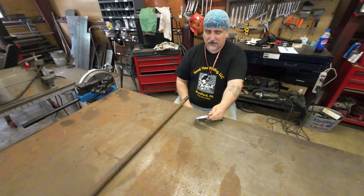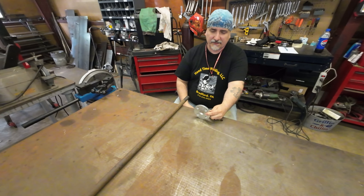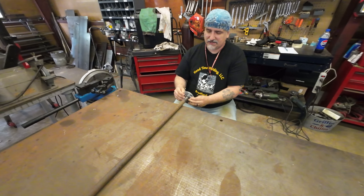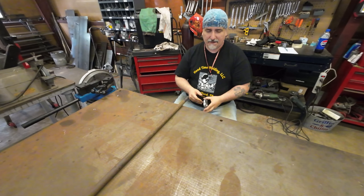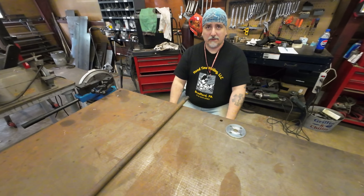It's a small flange, gonna be a pretty easy thing to do. The big thing is once I get it on here, I'll put a tack and just make sure it's square with the pipe once we get everything tacked together. Pretty easy thing to do with that, and then we'll move on to the second one.